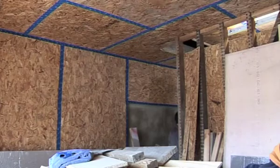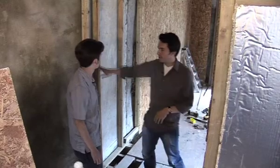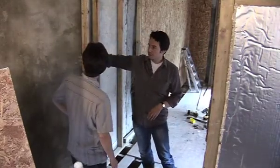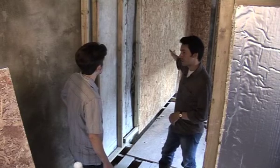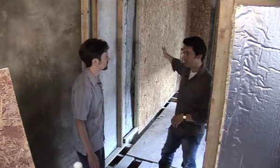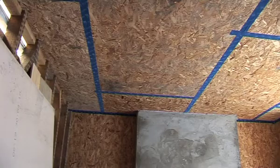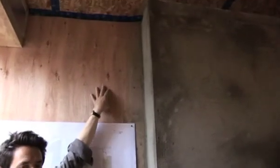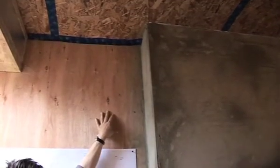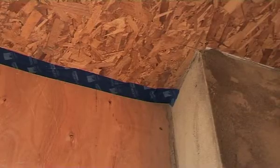As you can see and probably hear around you, we're lining the inside of the house for insulation purposes and air-tightness. You can see a bit of wall parging here on the staircase, and then going through — this will be insulated beyond and then over the insulation, OSB sheathing continuously to give us good air-tightness. That extends up to the ceiling. This section of wall behind me shows a piece of insulated wall, which is a party wall, with plywood sheathing in this case, which runs up to the ceiling. Again, the ceiling's been insulated and that's been sheathed with OSB.